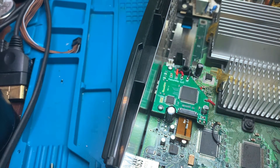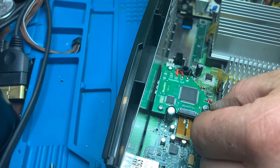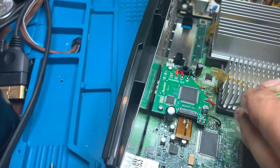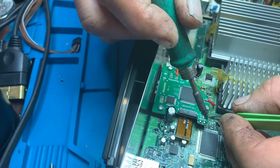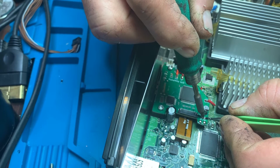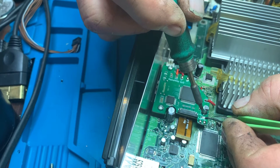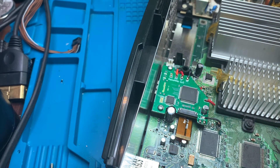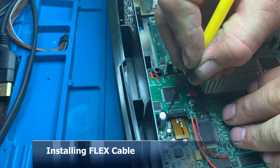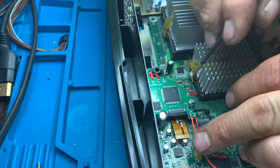This part is pretty simple — it's just tacking wires to pads, so there's not much risk of anything going wrong. You just need to bend things into the right place. I did change the tip a couple of times; using a slightly bigger tip helps because the pads draw a lot of heat away, so a bigger tip gives you more heat storage in the iron so it doesn't run out and cause a dry joint.